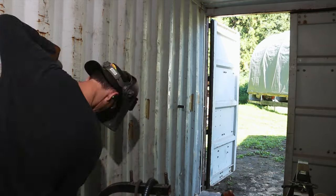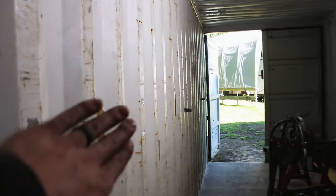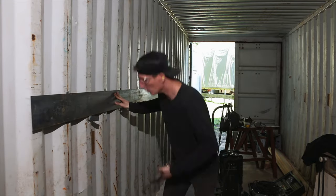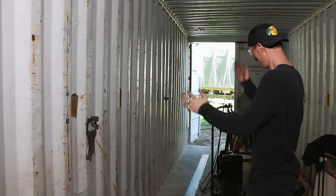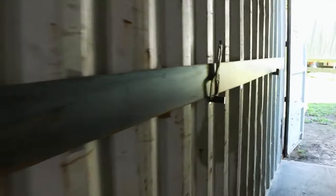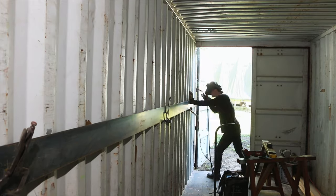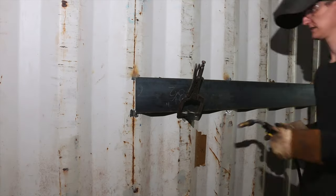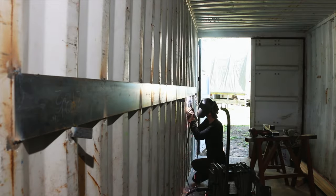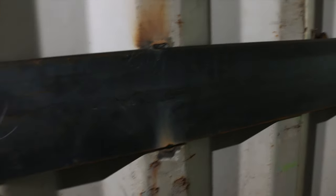I do not like the auto setting — that was not what I wanted. What I've done here is I just welded these bars on. This piece of 6 by 1/8 is so floppy. I'm going to see if I can just slide it up, put it on, hold it, and then just tack it along. Okay, got that welded on. Looking pretty good so far. We'll get the next one on.